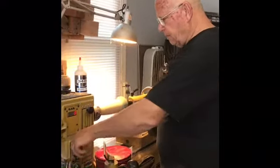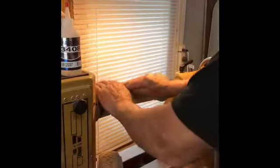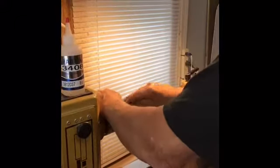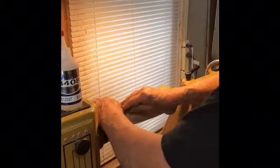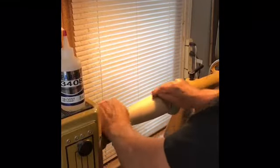So what we're going to do to prepare, I've sanded this down, right? And the last thing that I always do is sand this with 800 random orbit by hand, no machine sanding. Why we do this is so that there's no concentric circles on your material. The human eyeball cannot detect 800 random orbit scratches. That breaks up and diffuses the light, so that when you take this to the gallery, nobody will be able to see scratches.